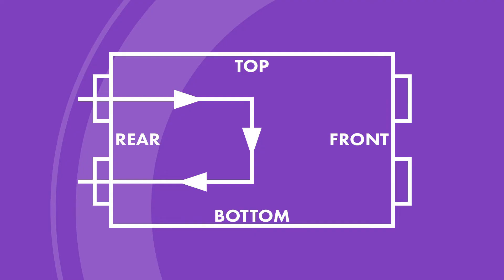If you own other external hardware, you would connect its outputs to the top row of jacks on the back of your patch bay. When a device produces a signal, it passes through the top row of jacks on the back of the patch bay to the bottom row of jacks on the back of the patch bay. If there's a device connected to a bottom jack, it will receive the signal from the jack directly above it.